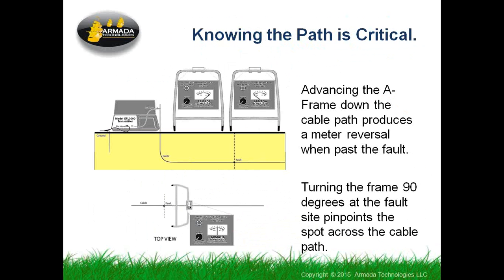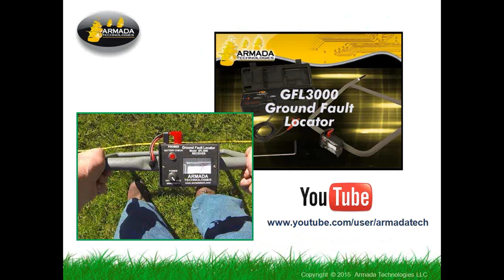So we're going to show you a little bit more physically how that works here in just a moment. I'm going to pull up this video that's on YouTube, but here's an illustration when you're looking down at the A-frame as you're following the cable path, poking it in the ground. This is what the meter looks like. You'll be able to turn the transmitter on, turn on this meter, and then make your walk down the path. So if you hold on just a moment, I'm going to switch over to this video, and we will be able to hear what's going on.